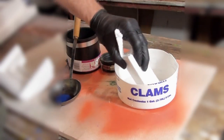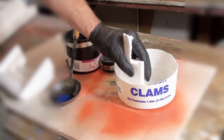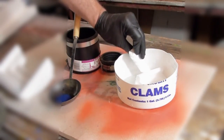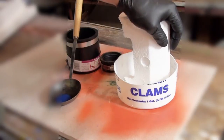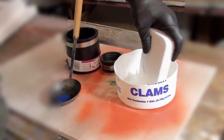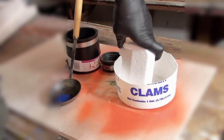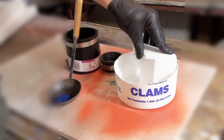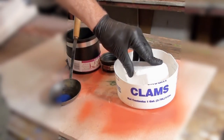So be really careful with this — not only do you want safety glasses, but you want to be careful about where your open flames or sources of spark are. That's also why people who work with these solvents store empty drums or cans upside down, so that the vapors come out and dissipate in the air. Also, these solvents are very toxic to your nervous system, reproductive system, liver, and kidneys — they can cause cancer, skin damage, and cataracts, which is why you want to do these experiments outside.